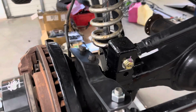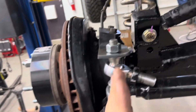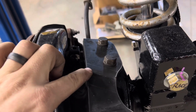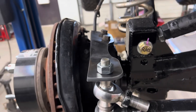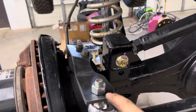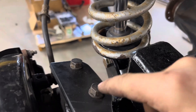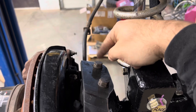Fast forward a little later — here's what we have. That piece we cut out came flat. This bolt and those bolts are on different planes, so we put it in the press brake. Did a non-square brake to bring it down, which adjusted our angles right, and then did a second square brake to level it out. Everything lines up. I always cut my plasma holes slightly smaller and then ream them out with a hand drill to the correct size. These back holes I had to file as ovals because they're not square with everything else — one is oval left to right, the other is oval front to back.